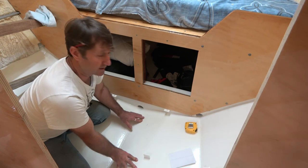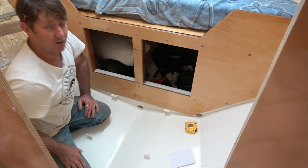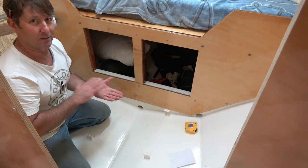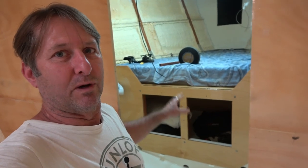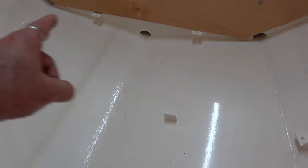So I'll just work out the measurements for the lengths of these and as you can see the hull is tapered of course, so this end is going to need a taper on the end of the angle at both ends so that it fits snug. What I'll be doing with that is using 12mm marine plywood, but then it will be laminated with 8mm of rosewood and I'm going to end up with a bit of a fancy cabin sole look - very nautical. Lots of people would have seen it but I'll save that for later. I do love getting into new jobs. I'm going to be working on this v-berth in terms of fitting it out with cabinets, so I decided that this floor space or cabin sole space would be far, far nicer if I can have a cabin sole or at least some board in there to give me a flat surface to work on. This is where I'm going to put some angle iron, then the cabin sole would be able to sit on top of that at the right floor height.